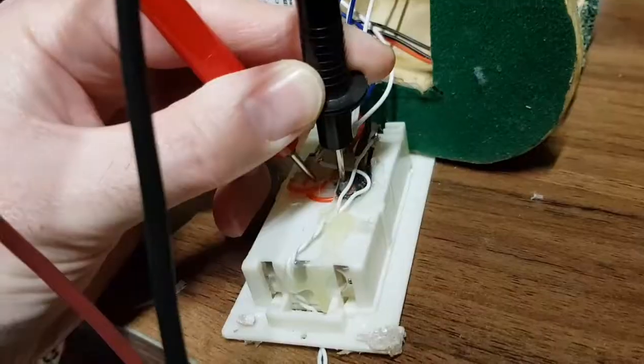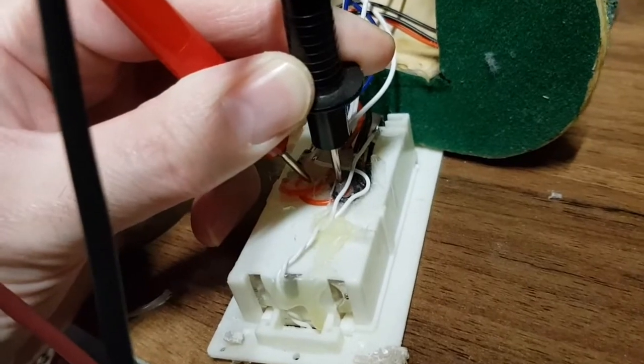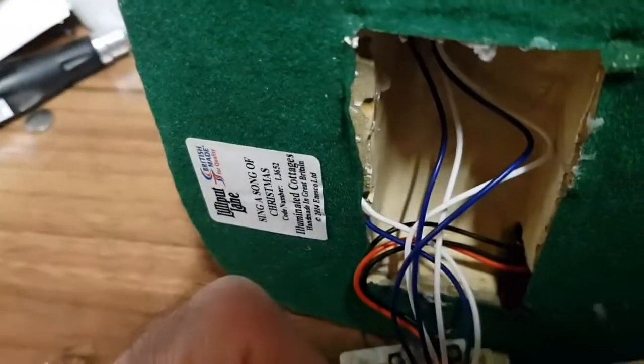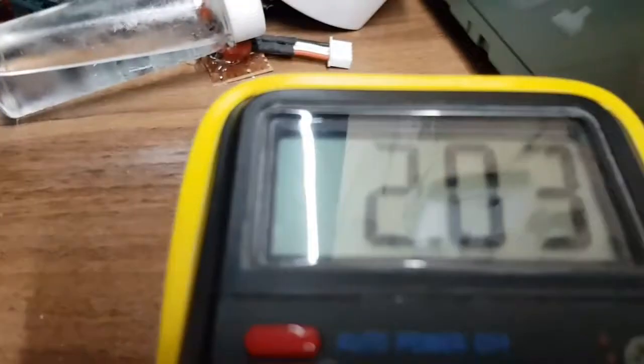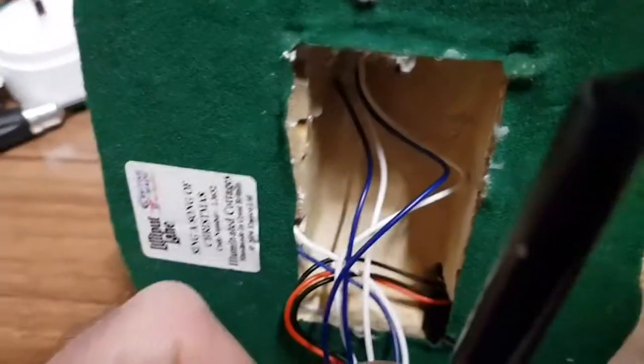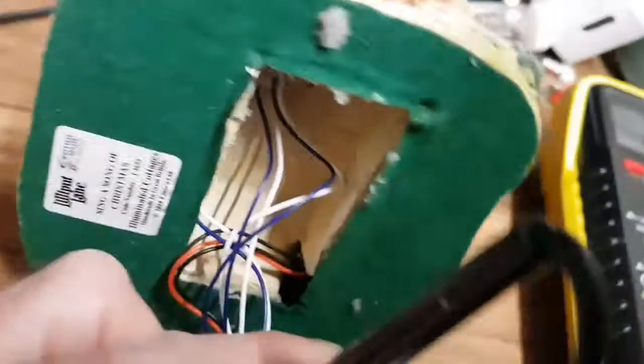Where I'm probing is the join point of all the LEDs - the blue and white cables that go to the LEDs all meet here. There are two volts across them - I'm powering this with the bench supply. Two volts across all three LEDs, but there is no light. If you look down here you can see the lights are not lit - trust me on that.